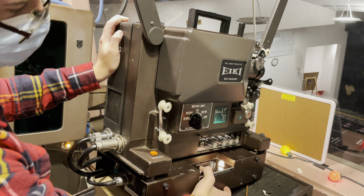We grab a take-up reel, which is stored underneath this projector, and we make sure to place it into the back hole. We make sure not the circle end, but the square peg goes away from you — you can see the square peg right there. We simply stick it on, make sure it locks in, close the tab, and now it's free spinning.